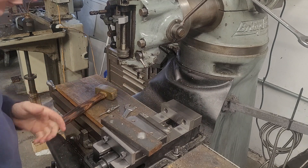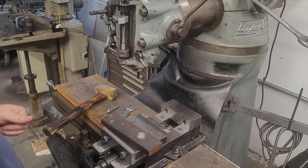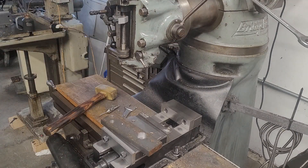I did hit this a little bit too hard. Instead of using an 8 or 12 ounce hammer, I used a 3 pound drilling hammer, so I smacked her pretty good. Now, this technique is more precise the smaller your center punch mark is. But first things first, we're going to get the part seated square in the vise.